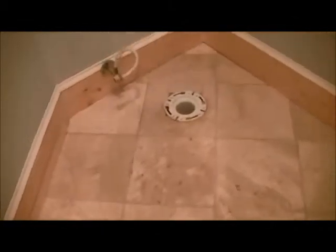This was the toilet area, and it got straight 12-inch going across. Of course, there are diagonal cuts because of the shape of the room, but this got 12-inch. We did transition from this pattern here. It was too difficult to try and move that pattern into this area, so the transition got made with this marble strip, and went ahead and put up the base. This base that used to be, well, it's right here, all painted nice and white and everything. It's a 4-inch, 4 by 1, and so went ahead and replicated that.